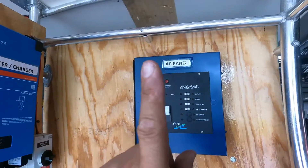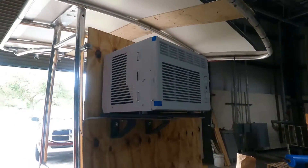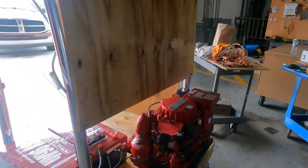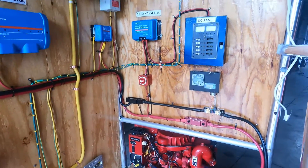I am going to install lights on the roof, a wonderful air conditioning unit — 6,000 BTUs — some loads, and outlets. And this is the generator. I selected the Westerbeke 3.0 basically because it is the smallest I have available, and 3.0 kilowatts is enough for this project.